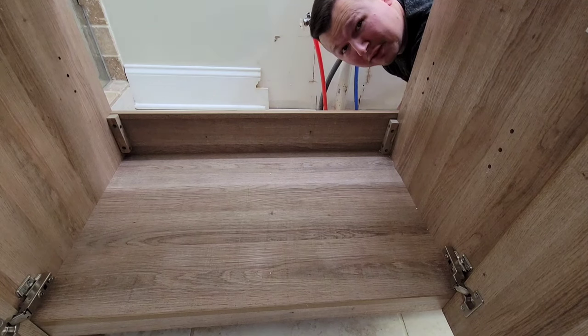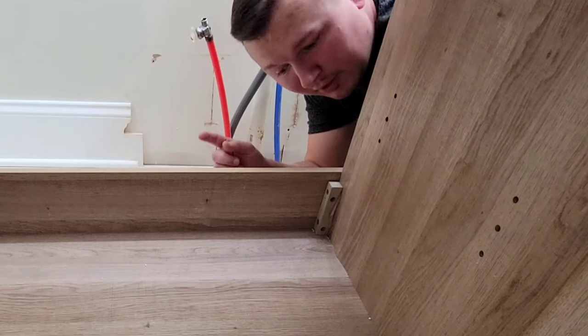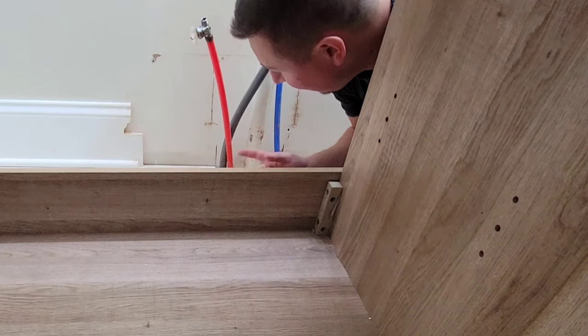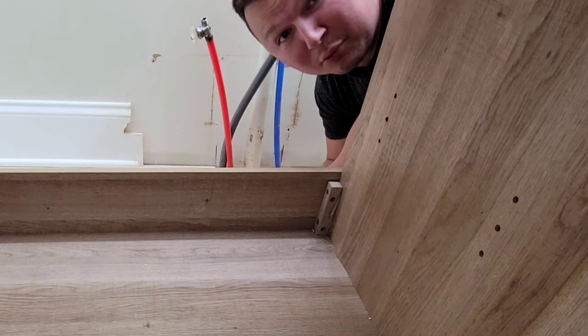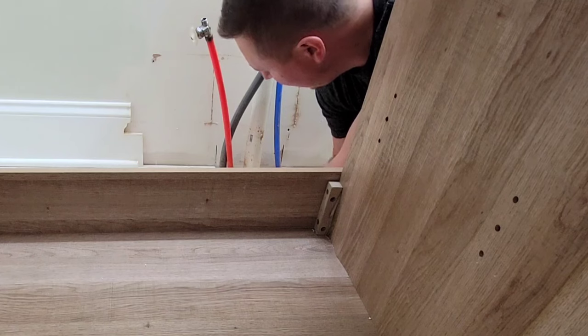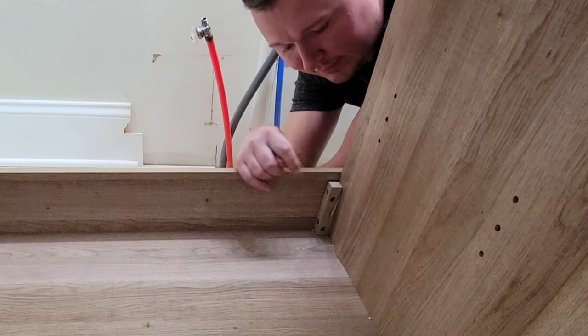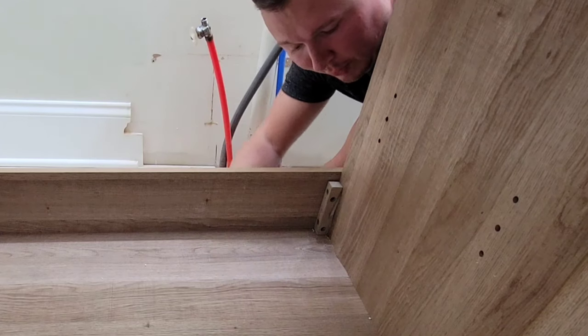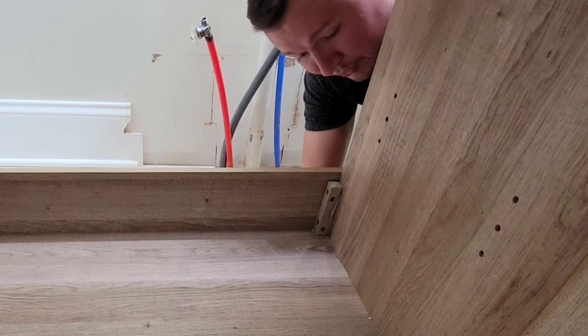All right, guys, so I'm under the left side of the vanity and I'm going to need a hole about right here for the drain, the hot water supply, and the electrical running up through the bottom of that thing. So I'm going to go ahead and measure it out, kind of gauge out just a little square right here, take my multi-tool, cut a hole out of the bottom,